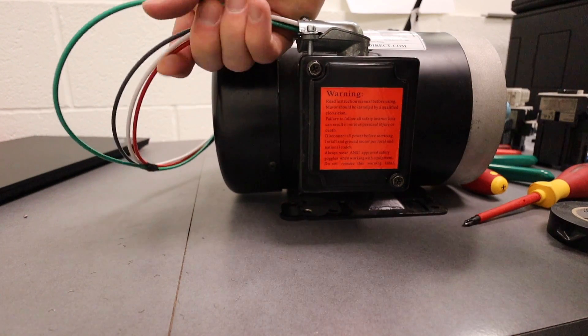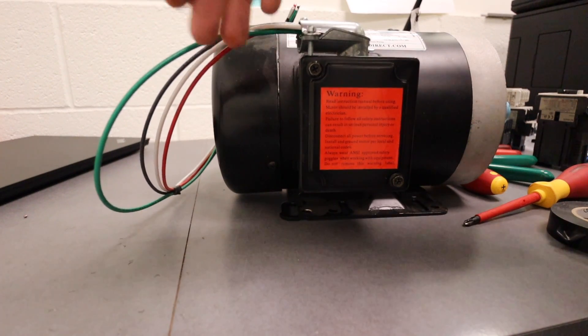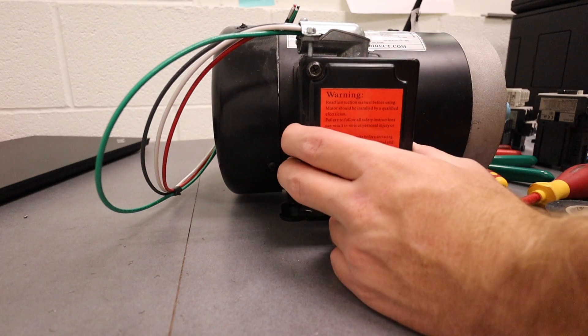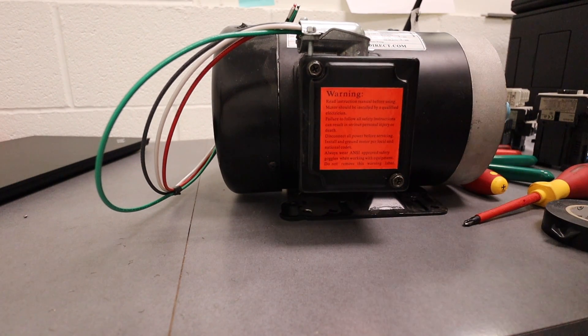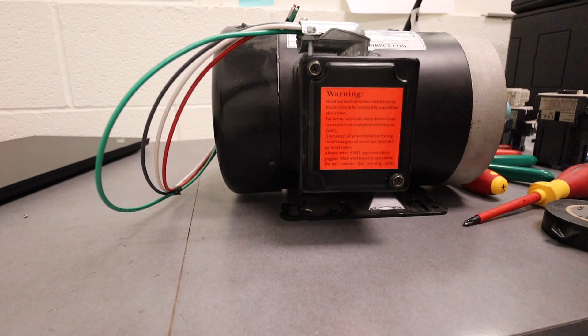You're done. This would not normally look like this with the wire coming out — I'm just showing you how to wire the motor. Always make sure you're putting the covers on, wire nuts are tight, always put electrical tape on them, and make sure you have the right size wire connectors. In the next lab we're going to wire up one of these motors. This video was just for wiring 480 volts. Moving forward I'll do a video on wiring 240 and go over those wiring schematics too.